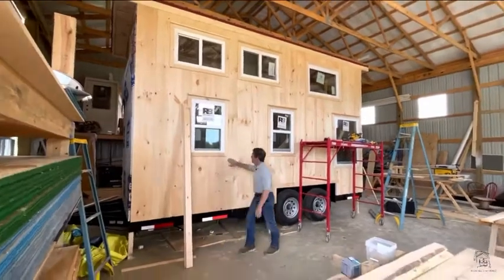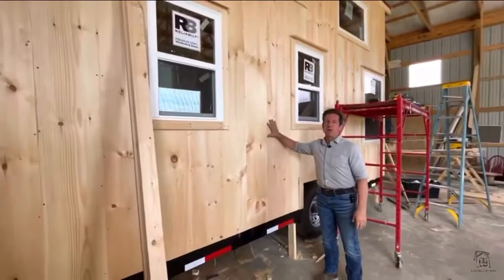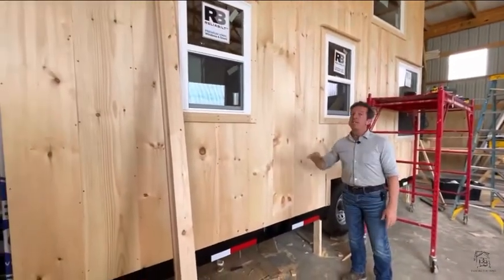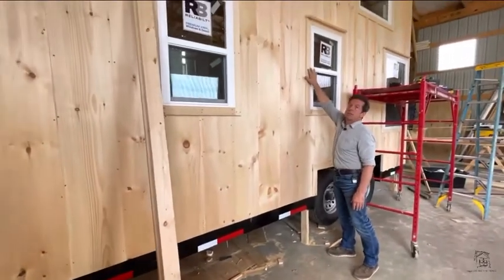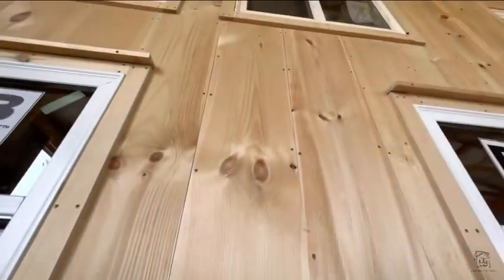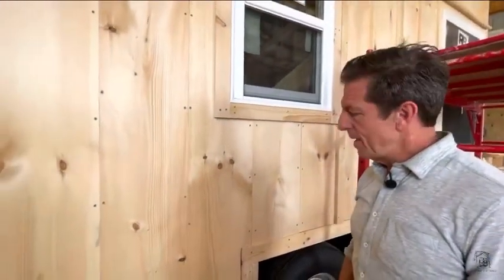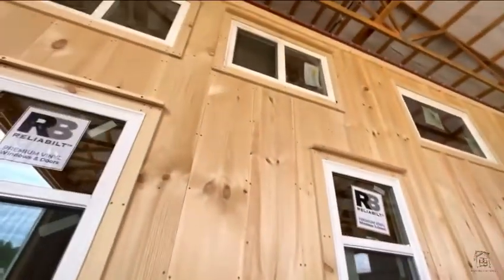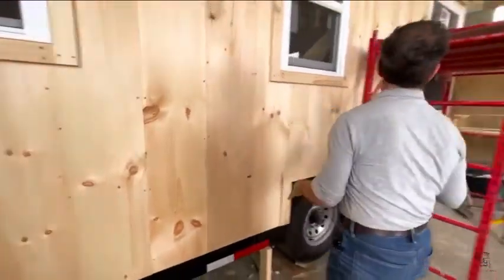I want to walk through. They requested that all the trim or all the siding be screwed off. We used to screw them all off — we used to put screws on everything. We went to nails because the screws visually can sometimes be unsightly. But they think screws hold better, and that's why we always went with screws. That's a lot of putty to put in there to cover that. So we put an adhesive, and then we put our batten strips over these. You can see them down here.